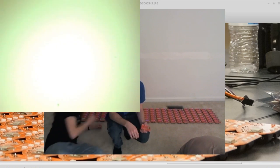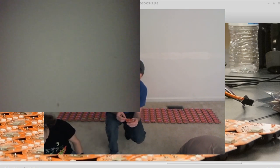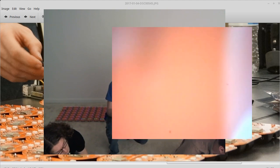But yeah, the peripherals on these: we have 4 WS2812s, so you get a little RGB color bar across the top. You have the 8 buttons that you can use as a controller. And then there's a bunch of unpopulated pads in case people want to take them to the makerspace and hack them, which didn't end up being terribly effective because the makerspace lost a bunch of tools in the warehouse, so they didn't really have soldering equipment.